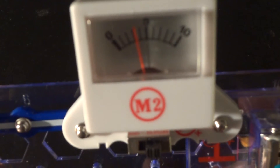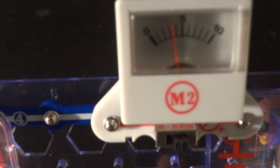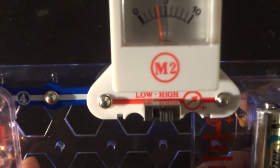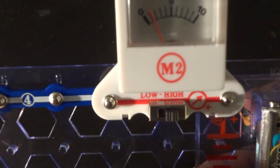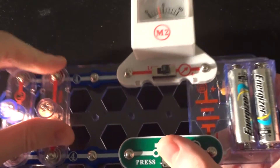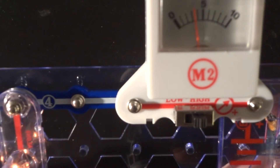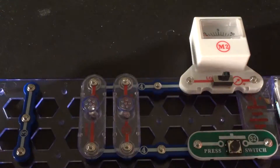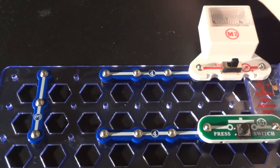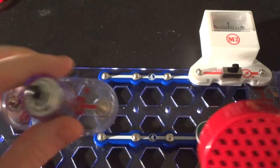The meter is showing about 300 to 400 milliamps of current going through the circuit. Most of the current is actually going through the 6-volt lamp, because the 6-volt lamp requires a higher voltage source, so it's drawing a little more current than the 3-volt one. That's how lamps work in series and parallel, and you also learn about their positive temperature coefficient.